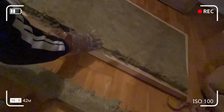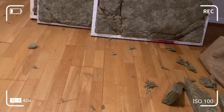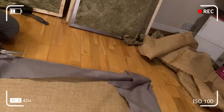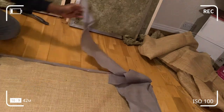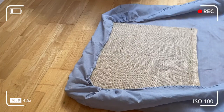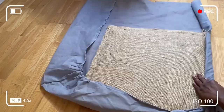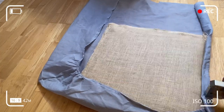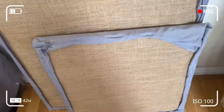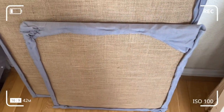If you haven't got enough pine wood, you could utilise canvases or picture frames — just install your rock wool onto the base of the backing fabric stapled onto the frame. At a later stage in the video I'll be installing a quality acoustic front fabric panel, which is more expensive than conventional bed sheets. To install the front cover, lay your front cover down and turn the backing frame with the rock wool upside down so it faces the front cover. If your breathable front fabric is quite light, you can double up on the sides before you staple down; if it's thick, just staple all the way through.